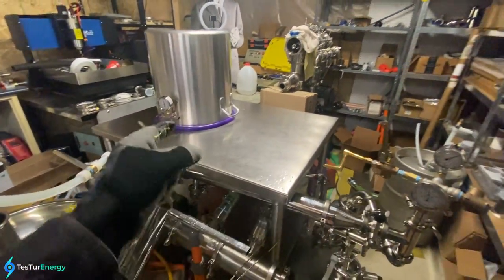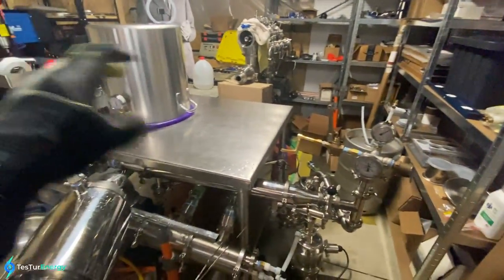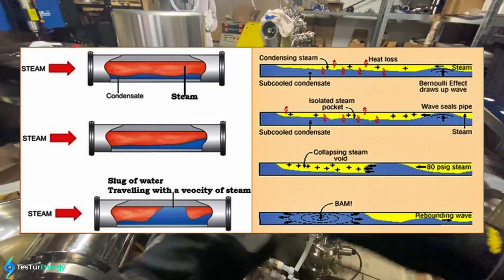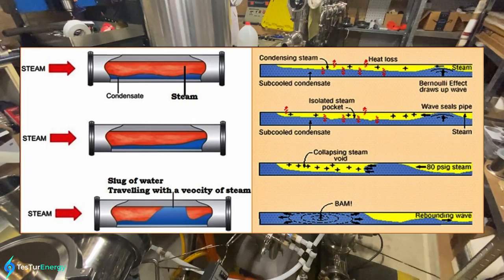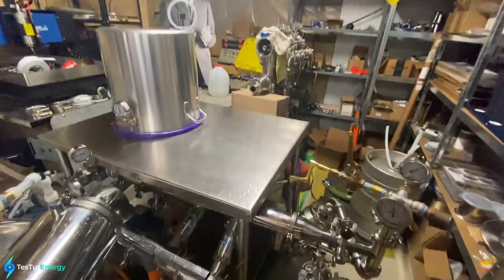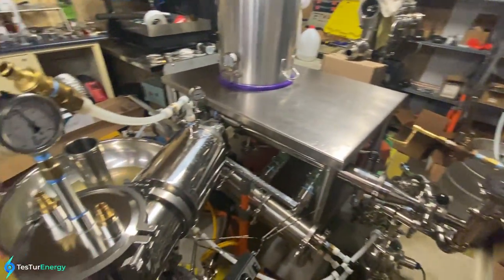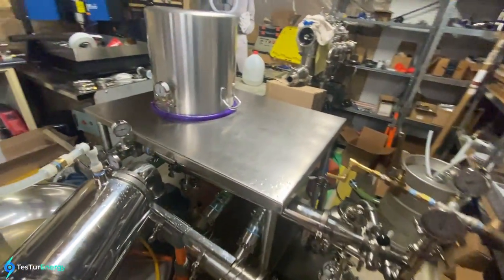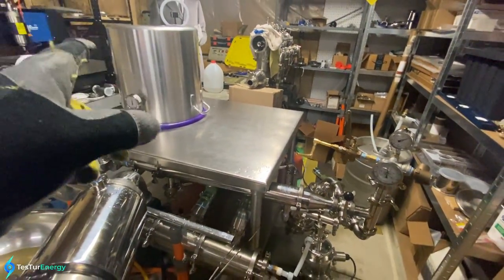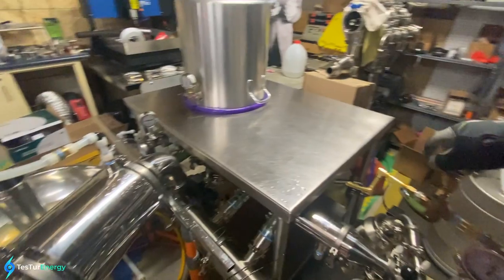I was having an issue with flooding right before the turbine, sending water slugs into the system — I was really worried about damaging something. It wasn't even that; it was moisture causing really bad water hammer. That's been resolved. I got this to spin up a little while the other day. The pressures are a little high right now so the temperature is much higher than what I want going into the turbine, so I need to bring this pressure down.